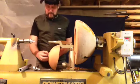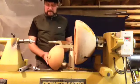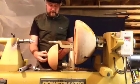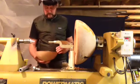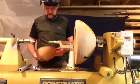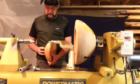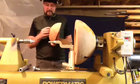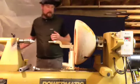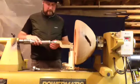One thing I do, if I need to do some light turning, I have used the tenon that comes from the cutter. It's very small, only 1/8 of an inch or so. But if I needed to do some light turning to round the edges or some preparation for drying, I do use that on occasion. But generally I'll either use cole jaws to make the tenon larger and more secure, if I need to get any material off the bowl before drying on the lathe. Absolutely, yes.